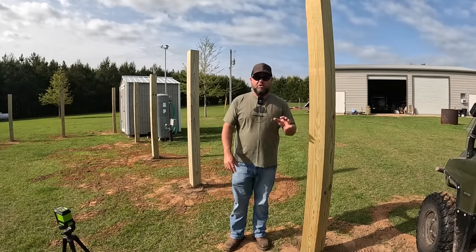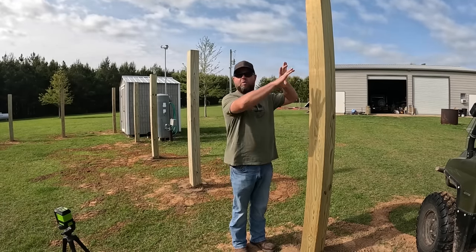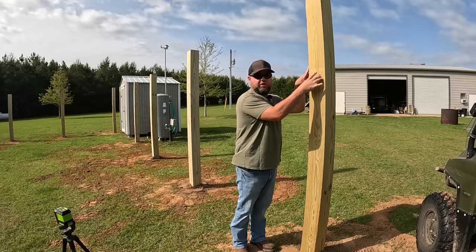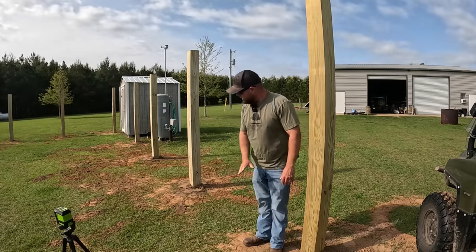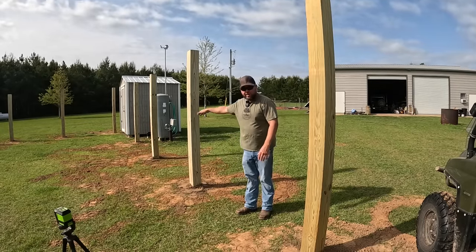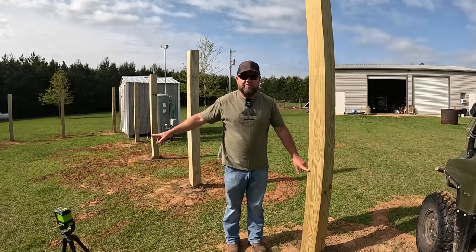I came back and found my lowest post, which I could physically just see. I used this reference line to measure down, measure up, and figure out where I wanted my horizontal runners to go. I know that this post right here is going to have my longest fence panel — I bought six-foot panels to nail on here. Starting from here going all the way back around, we're going to have to cut almost every single panel because we want the top of our fence perfectly level. The fencing panels are going to have to follow the ground that's sloping, which makes a lot of extra work.